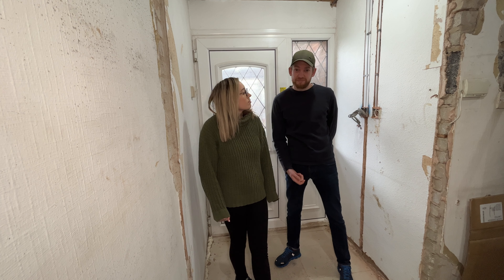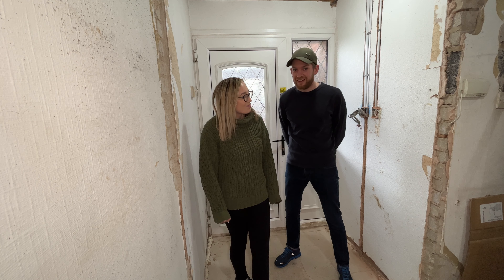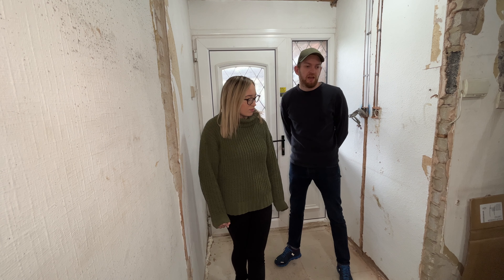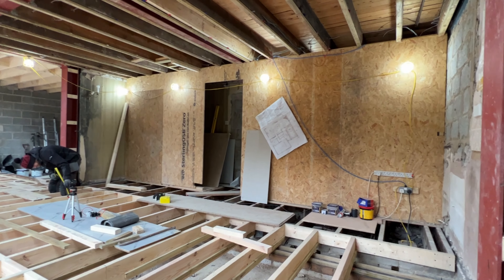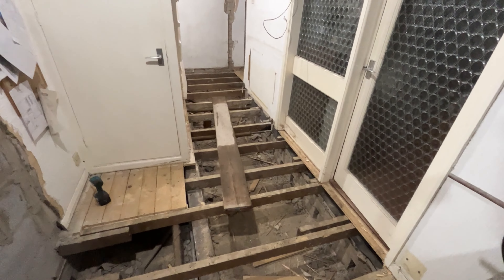It's effectively the same level, apart from a couple of millimetres for the cement boards on top. If we were to lay the board on top of the joists, with insulation and underfloor heating on top, we would have increased the floor height by at least 50mm. When our ceiling heights aren't crazy tall anyway, that would have been detrimental to the space - it would have reduced the ceiling height to less than 220cm, and 230cm is probably your limit.